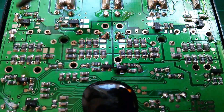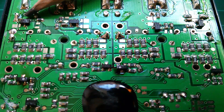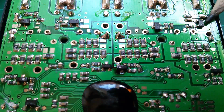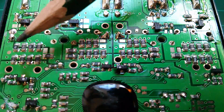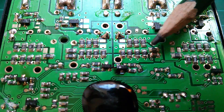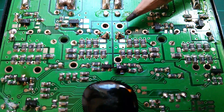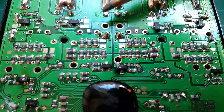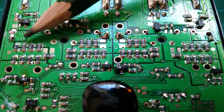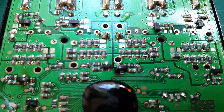We can see there are four transistors up here. This one's split — that's broken in half. That one seems to be okay. This one has a little sweat mark on it, so I think that one got hot. And this one seems to be okay. Now looking at the resistors: these four have got hot, these four are fine, these four are burnt, and these four are fine. I think what happened was I had two cells in this — often in positions one and three — and where these components have burnt out is where I had cells in the battery charger when I put 12 volts onto it.